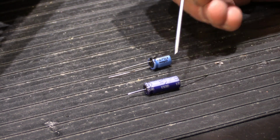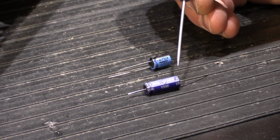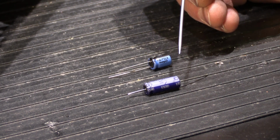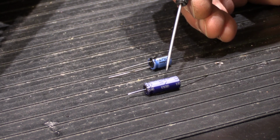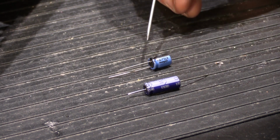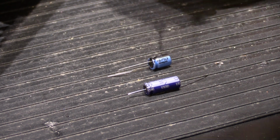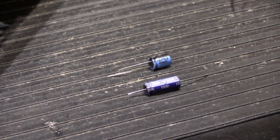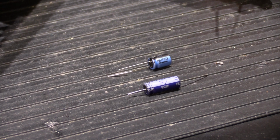Axial capacitors are old school capacitors, and for the most part they fell out of favor probably sometime in the late 60s, maybe early 70s for the most part, not in all cases, but generally speaking, yes. And then radial capacitors became sort of the norm. This set was made in 1967. It was fully populated with all axial capacitors when it was brand new at the NuTone factory.